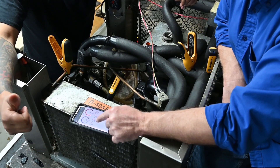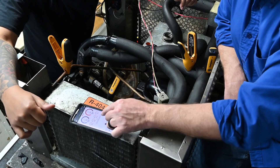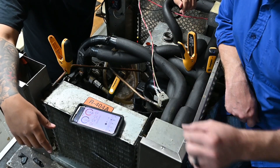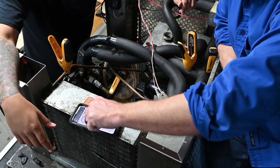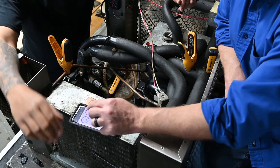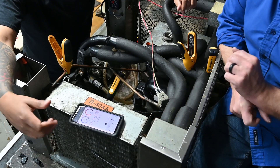High superheat — low charge. So this is cool because the app calculates a bunch of stuff. See this little green arrow right here — our liquid pressure should be up close to that green arrow. Our saturated temperature is minus 4°F, so our saturated temperature is too low as well. What do we need to do? We need to charge it. So we're going to get the refrigerant tank and a refrigerant hose.